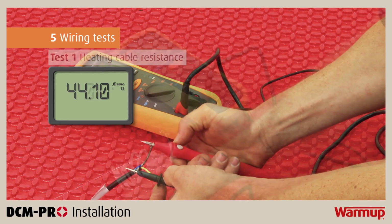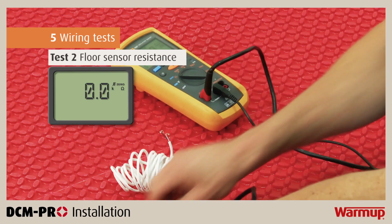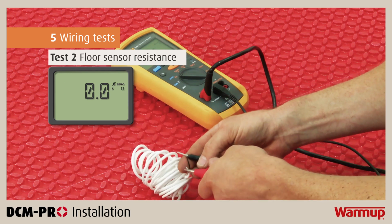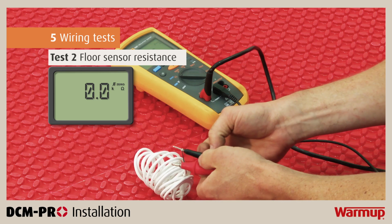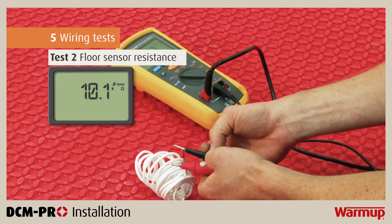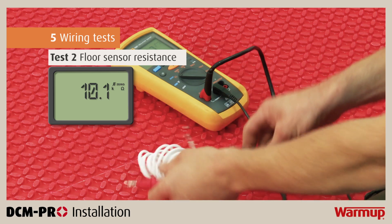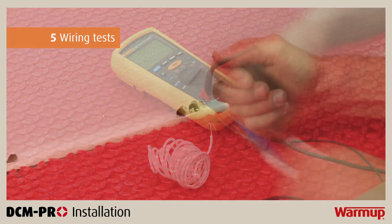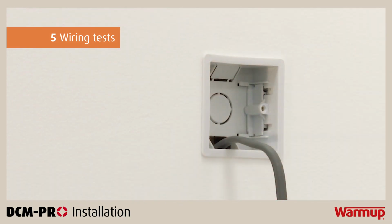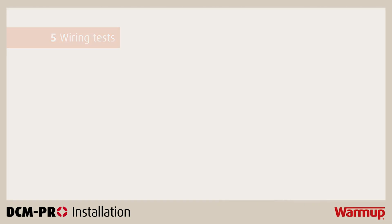Finally, test the resistance of your floor sensor by using a multimeter set to a 20 kiloohm range. Connect the meter to the sensor leads and compare the results with the expected figures in the installation manual. Make sure you record these results in the control card. Next, thread the cold tail up the wall and through the electrical back box.